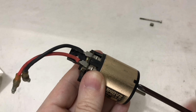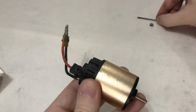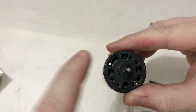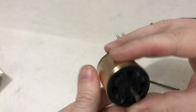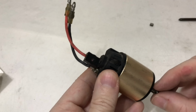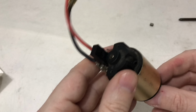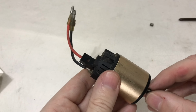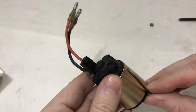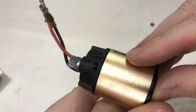So all I'm going to do is we're going to nip it up and then I'm going to take it back a turn. So that's in position, and now this might be a bit easy. The problem is the screws are going through these big sections here to allow the end bell to turn. So although you can see it all the way through, you've got to sort of locate it, and you've only got this bit of movement with your finger and thumb to find the hole. Oh, I thought I had it then. Come on. Nope. Riveting video again, guys. Nope. There's about 3 mil of thread comes through when you get it right. There it goes. You see that thread pop through?